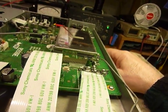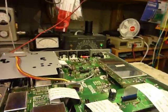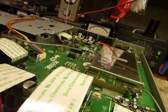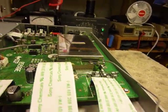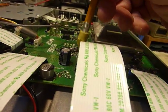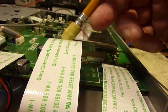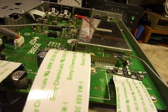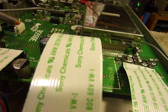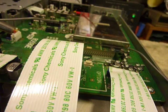The next thing I did was start poking around with a pencil to see if anything was loose. I poke at parts, I poke on the board — and I hit this component here and heard a beep, because I'm feeding a signal in. I checked with the generator and did it again — it was picking up the generator. So the receiver is working, the audio is working, but for some reason it's not getting where it belongs. I kept poking and found something reacting right here.